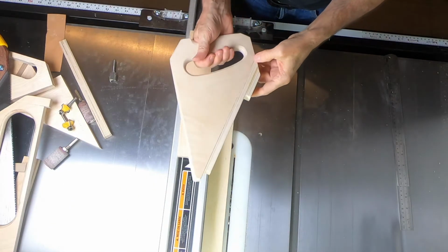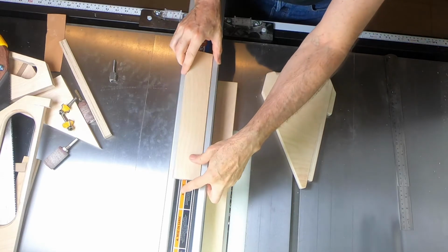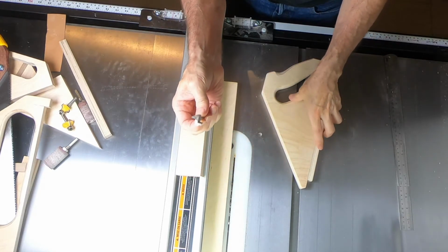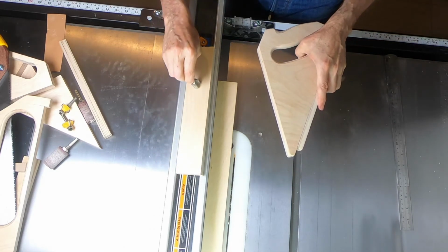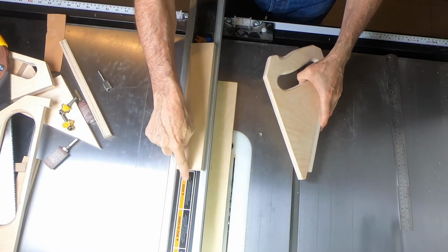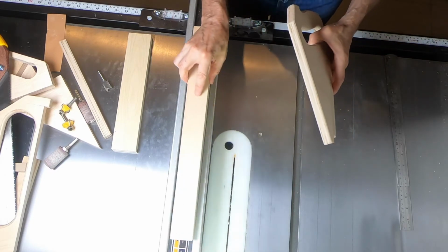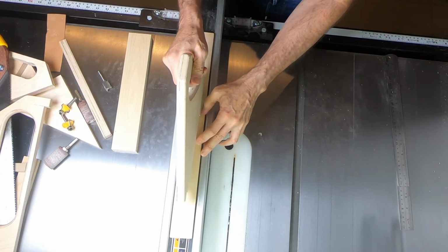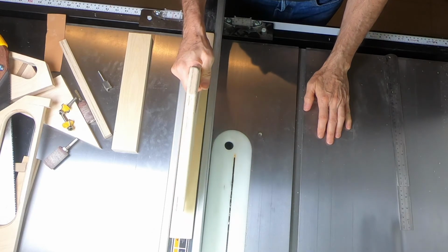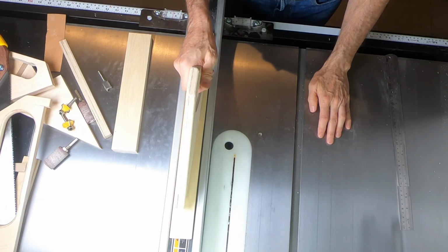One final note about this: if I were using this all the time, and I know a lot of people do, then I would make a little insert here for my fence that fit really perfectly in, and then I'd use my undersized bit to get a perfect fit dado groove down the middle, and then I would screw it in. I'd drill and tap small holes into my fence actually, and then I'd be able to, imagine it's here, we can just use it as the example, have a perch for it where it just fit in perfectly and just leave it there, right? Or if I were doing a bunch of cutting, I could just always stick it back right on there.